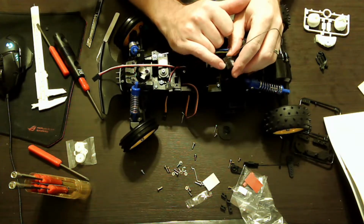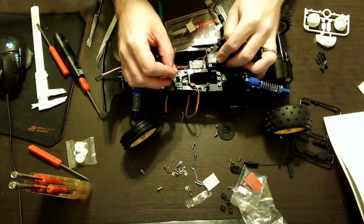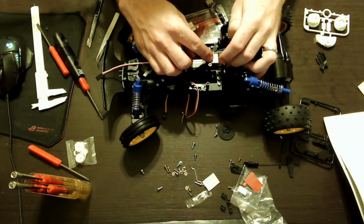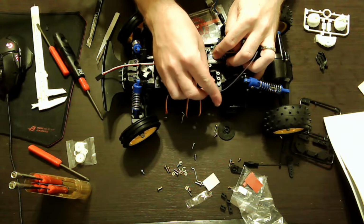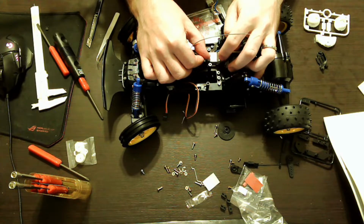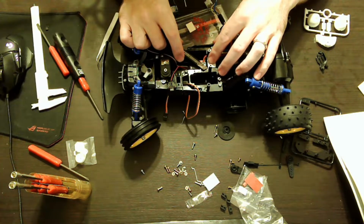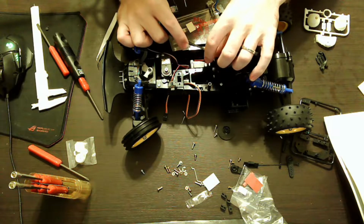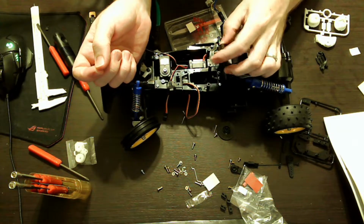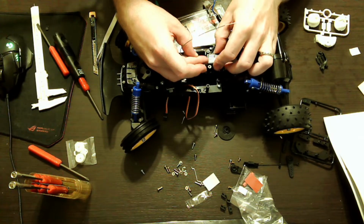This actually has this little button right here, and this is what you use to enable and disable the gyro. And again, for ease of service, I don't want this thing to be here, because if this ever takes a dump, then I need to rip the whole thing apart. So I think if I have them right here, then this guy can go over here, and it'll stick up just right. These cables are long enough anyway to go to the receiver. So let's go with that, see what happens. Double-sided sticky tape at the end of the day is very cheap, but I guess I could have gone this way too. Oh no, I couldn't, because it doesn't fit. It's not wide enough. Could go this way. No, that's going to screw up the gyro. So we're going to go this way. Yeah, this will be good. I like it.